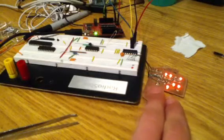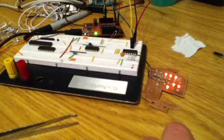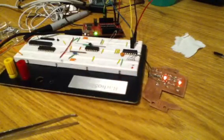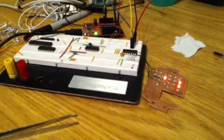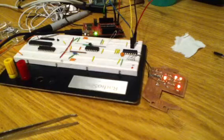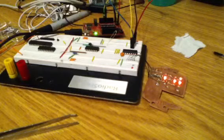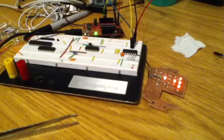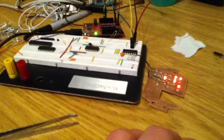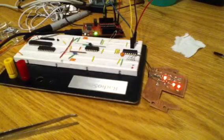This is a 24-hour display, so when I started this program running, it started from 0 and counted up to where it is now. The display goes from 0, which is 12 o'clock midnight, to 23 hours, 59 minutes, and 59 seconds, which is 1 second before midnight. This display is actually not true binary, since it does not display minutes, hours, and seconds in binary. What would be true binary is displaying just seconds, and then you having to figure out what the appropriate time is from that, but that's a little bit too complex for most people to handle. So this was my easy display, which only requires you to know binary up to 9. That's a little bit easier for those who are not yet binary competent.